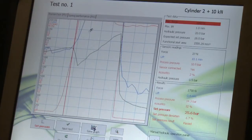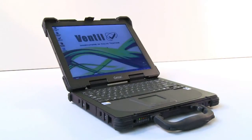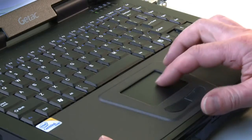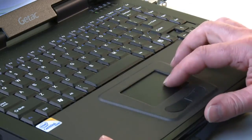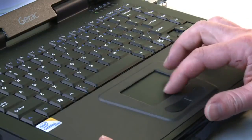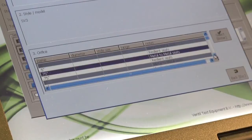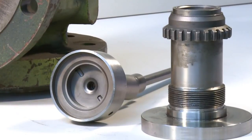The Windows operated Prevent test program is designed for the versatile valve repair and service industry. Besides controlling the test sequence and displaying the test data, it enables the user to enter, store and edit customer details, plant location and the safety valves in a very structured and easy way. A unique feature of the Ventil Prevent test program is the extended database with safety valve seat dimensions, containing the seat dimensions of several thousands of safety valve types and sizes of all common known manufacturers.